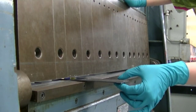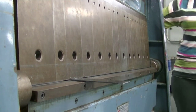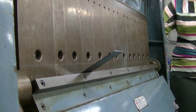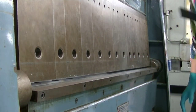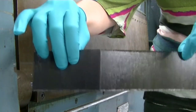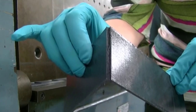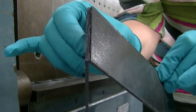Now let's try the composite material. The same procedure of clamping and bending takes place, but the result is a little bit different. Instead of creating a smooth angle like in the metal, the composite sheet fractured and splintered. There is a clear hinge at the brake line, and the sides are no longer connected. If you look even more closely, you might be able to see some of the fiber layers in the crack. That composite is definitely not usable anymore in an aerospace structure.